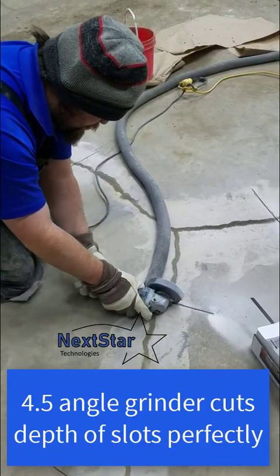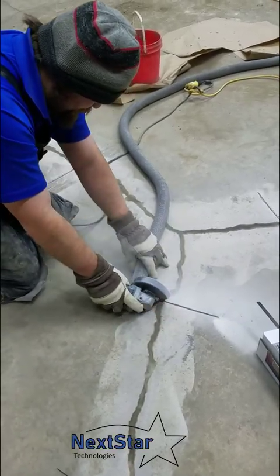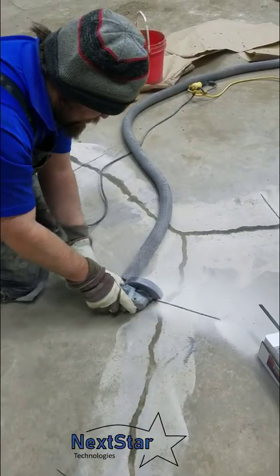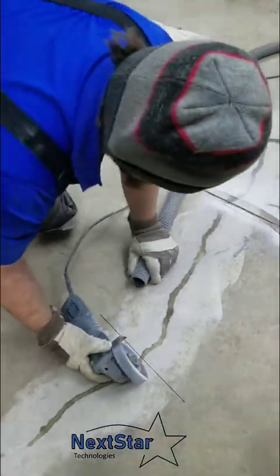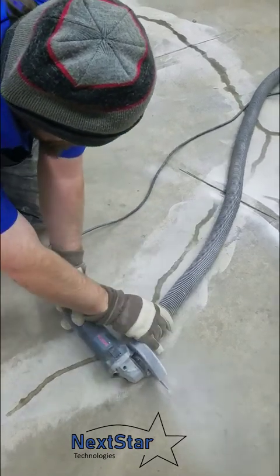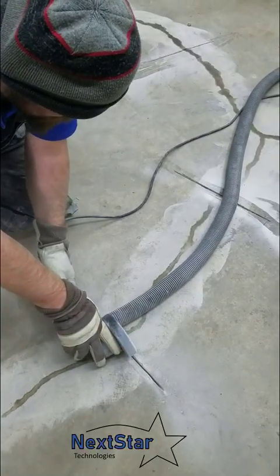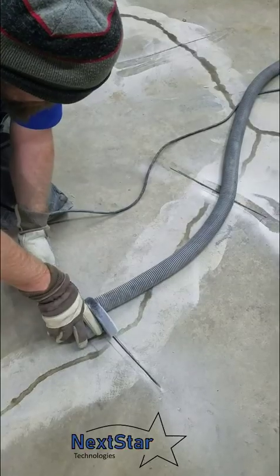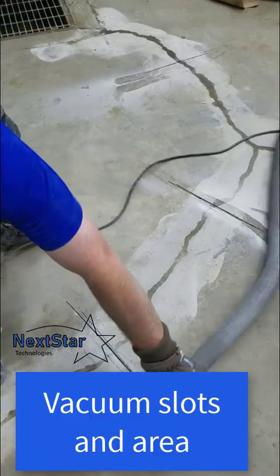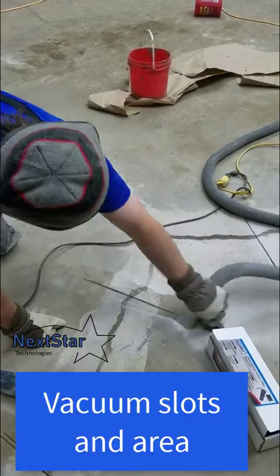These stitches are fairly simple. The epoxy comes in bags and the stitches come as individuals. You mix the epoxy on a piece of cardboard and just trowel it in — there's no need for a tube set or caulking gun. The kit is designed to be disposable to keep the price down. For large quantity orders, just send us an email. This video is designed for the DIY kit, which is 15 stitches with enough epoxy for that. We recommend fixing the crack first with 10-minute mender, because there's enough epoxy for the stitches but not for the crack repair around it.